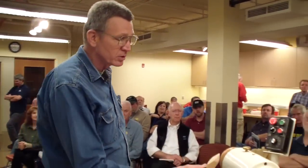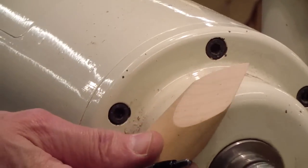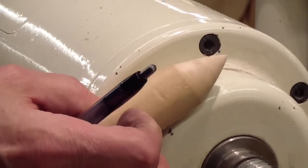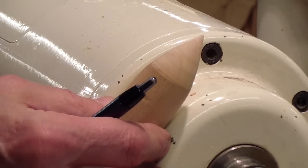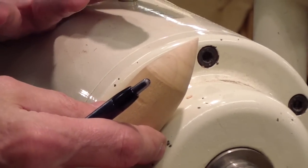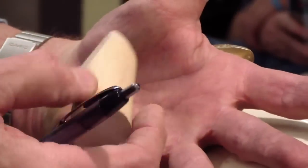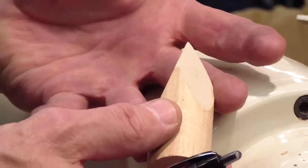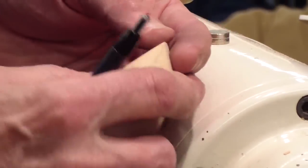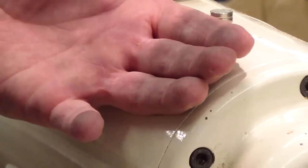This is important. Make this tool in steel. When you work with oak, ash, hickory, the things that have hard to soft grain, and you wanted that center to be right there, and you punched it, it walked sideways. Now it's over here. With this sharp edge, you point that in the direction you want to go and twist in, and it just walks right over there.